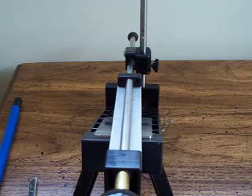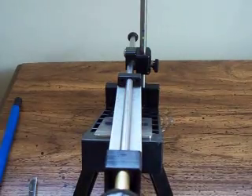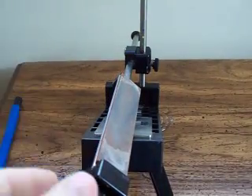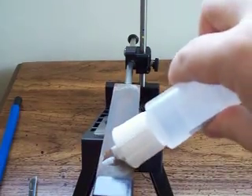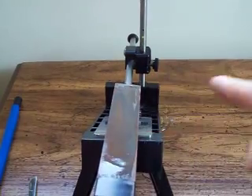I'm going to try to go fast and jump into this. Those are your angle guides for whatever angles you're going to use. I have a 330-grit fine stone on here right now. I'm going to wet it down with that little water bottle that comes with the kit.